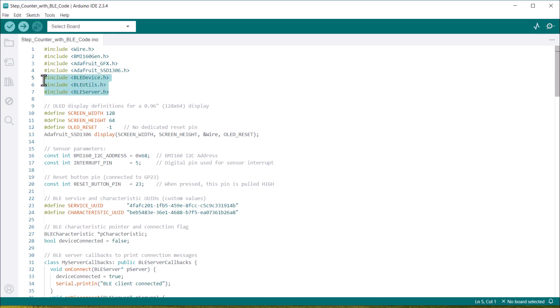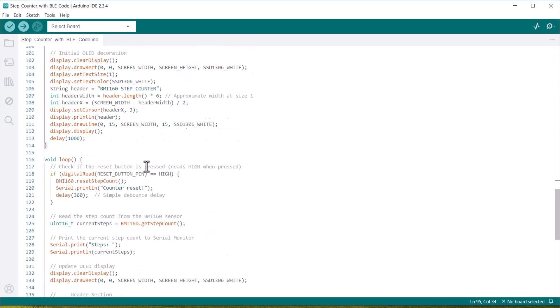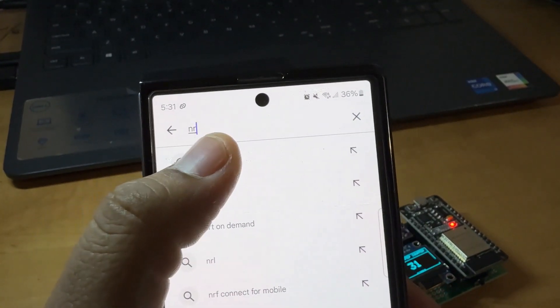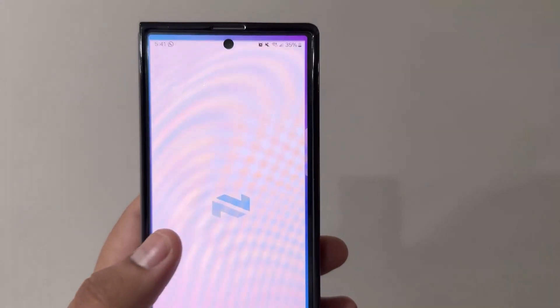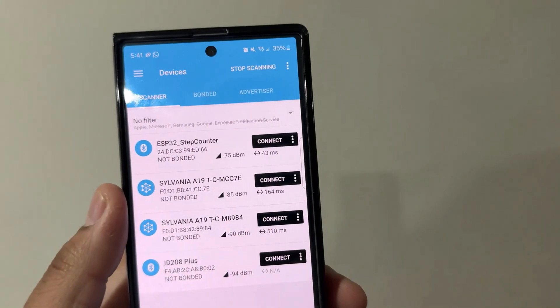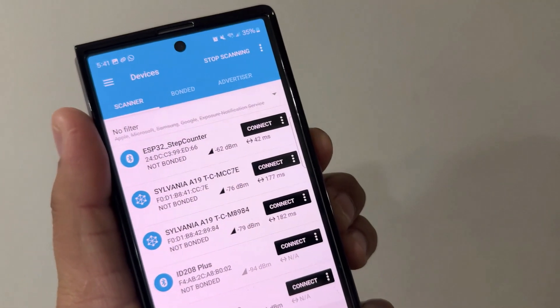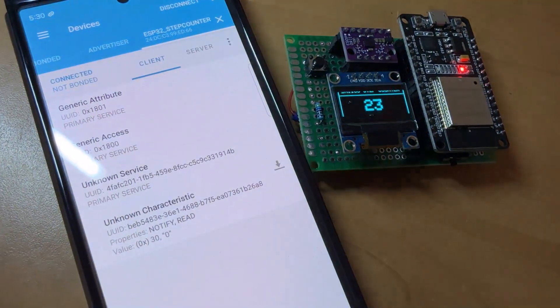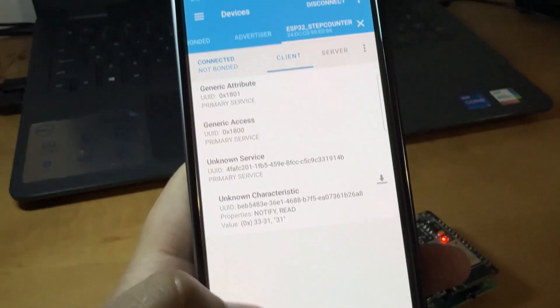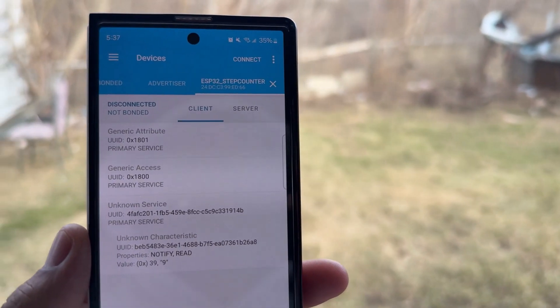To make this project better and to add wireless capability, let's use the ESP32 BLE. I modified the previous code and added some lines to communicate over Bluetooth Low Energy devices, then uploaded the code. To view the BLE data, you can use the NRF Connect app, available for both iOS and Android devices. Turn on your phone's Bluetooth and GPS, then open the NRF Connect app. The scanning process will start and a device named ESP32_step_counter will appear. Connect with it and view the characteristic with the UUID mentioned in the code. Click the download button and you will see the steps. The step count updated to 31 also appears in the NRF Connect app. To observe the data each time, refresh the app by clicking the download button.